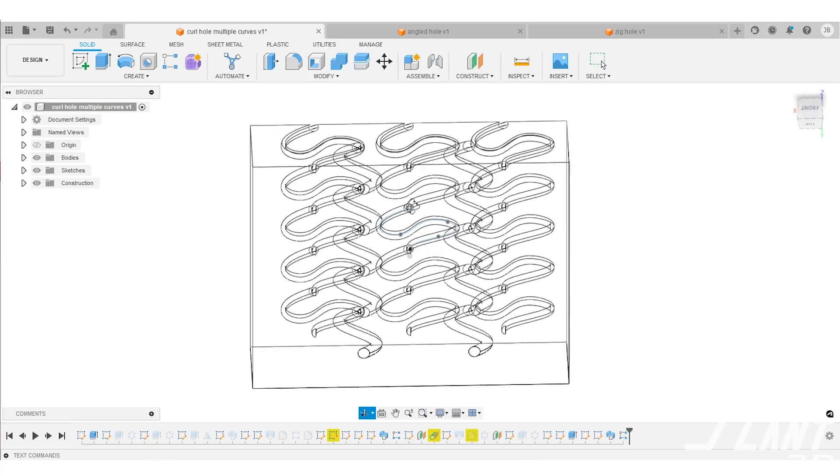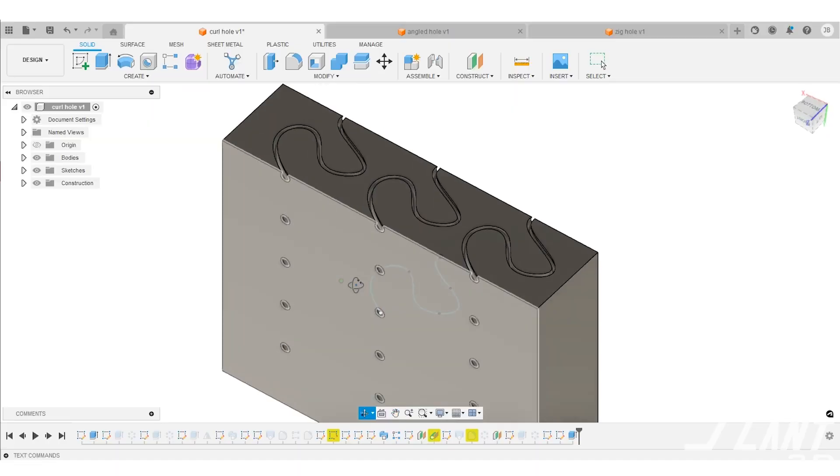Another option is to rotate the tube patterns inside the part — flat, then 90 degrees, then 90 degrees again — repeating that pattern so they overlap and combine. There are many ways to pack in a lot of path length inside the part, and printing has no problem with this complex geometry. As air flows through these S-curves, you can design little pockets that catch dirt and create vortices so the cover almost acts like a filter. You can also vary the diameter of the holes to change airflow speed. What was just a cover to keep fingers out of the fan can now be a functional part of your device, improving longevity and overall customer experience.